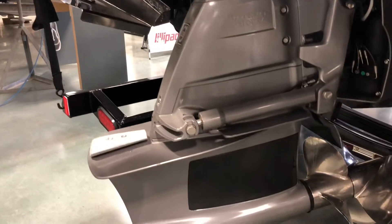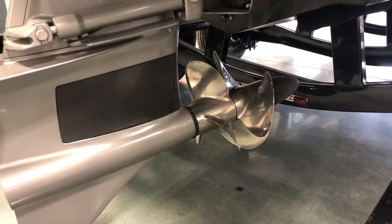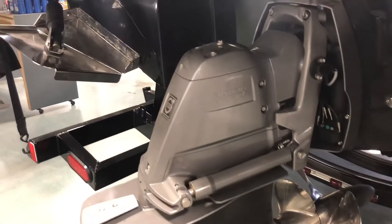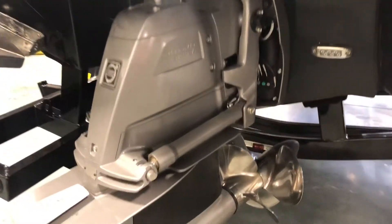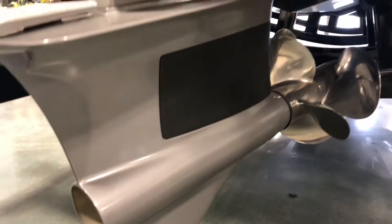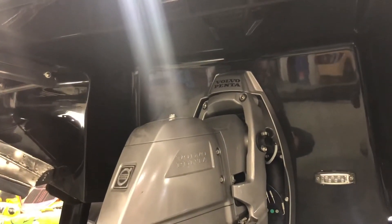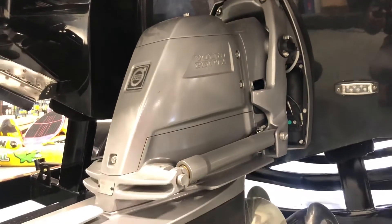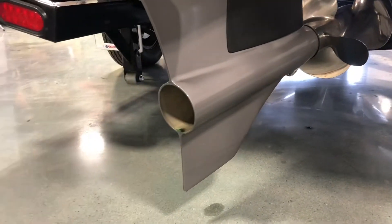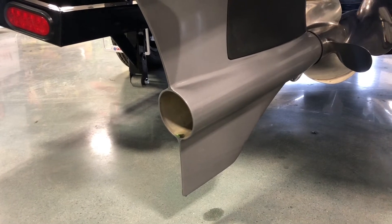You get the dual stainless steel props, and this is still some semi-new technology — we've had it for about five years now and it's phenomenal. Some of the really key features that separate this from the direct and V-drive world, the traditional tow boats, is the exhaust. A huge problem with those boats is exhaust below the swim platform — those fumes would drown out anybody being towed, especially surfers because of how close they are. Volvo recognized this problem and actually plumbed the exhaust down here, running it underneath the surfer, through the prop wash, and it doesn't surface until well behind the riders.